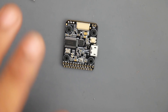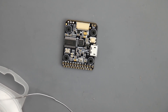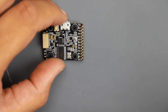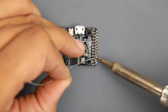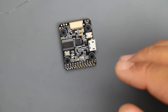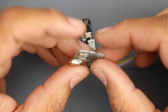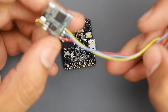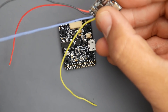The VTX is going to be all the way on the bottom - be very careful here. This VTX only takes 5V; if you have a different VTX you'll probably need to run battery voltage, which I'll show from the ESC. Our VTX takes 5V, so it'll be these pads: 5V, ground, video out, and T1. T1 is for smart audio, which lets you control the VTX's power, channel, and everything through the OSD menu - so you don't have to find a button on the VTX. Red is always positive, black is ground, blue is smart audio, and yellow is always video.